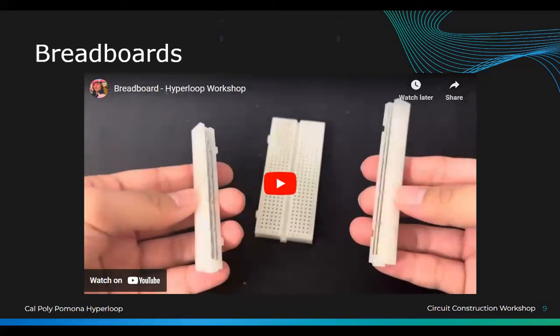So the breadboard, what needs to be connected basically at all times? Ground, right? So ground should be powered. And how do you power the ground with one pin? Yeah, so you just get one cable and you just dump it to the other one, right? Another question. If I'm looking at the center one, which two pins are connected? Any two pins are connected. Yeah, so everything on the same row is connected, right? On the same side.